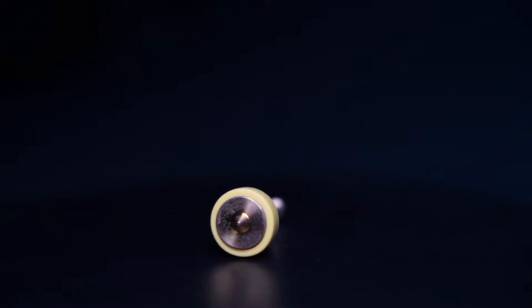Smaller than 0.25mm, particles of dust can actually clog your nozzle, and if you do get a clogged nozzle of something like a 0.15, it's going to be very difficult to unclog. But when you go up in nozzle diameter, you oftentimes will lose some of that quality and surface detail that you would get with the 0.4.